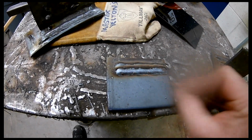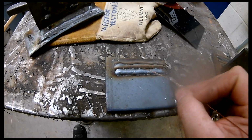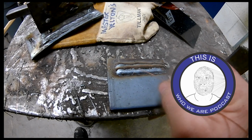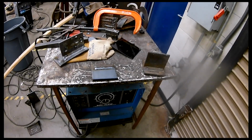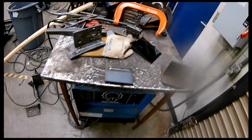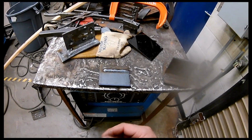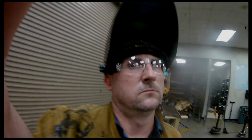So make a coupon, do your lines nice and straight, and remember, I want these welds correct, but I also want you to demonstrate that you have control of the gun. To do that, make these lines stack on top of each other just like I'm showing you. Okay, I hope that helps you get started with MIG welding. In the next video, we'll go over doing a fillet joint or a T-joint, and we'll talk about what it takes to do some very basic introductory certification.